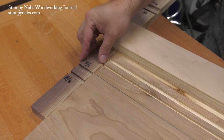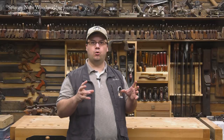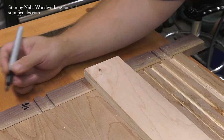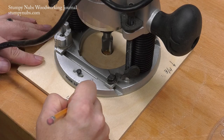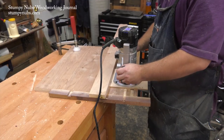Now let's get started with edge guide number two. This one looks very simple, but there's a clever twist to its operation. I'm not sure who originally designed it, but I got the idea from a Canadian woodworker named Sergei Duclos. The T-square has a series of notches in its cross piece, each for a different size router bit. The base of the router is offset, so it will align its bit with one of the notches depending on which side of the plate you run against the fence.